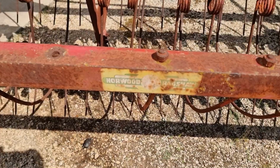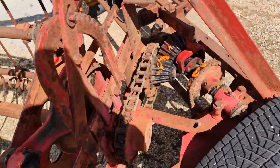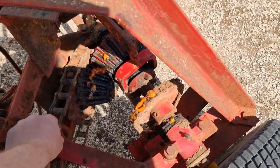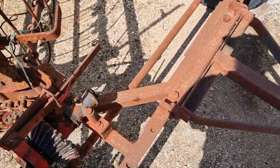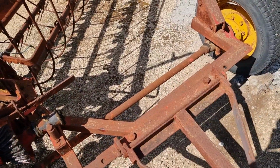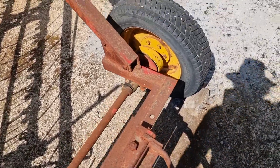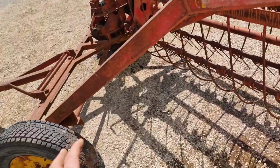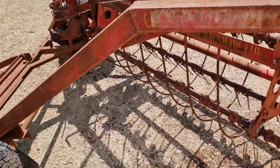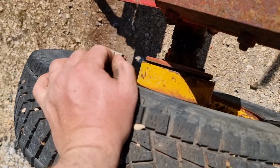So yeah, this is the Bagshaw. Everything's had grease, so I've just got to lube some chains up. And yeah, I've got the clutch working. The dog's clicking the wheels, so you can't actually disengage these ones. Which I think is a bit weird, because all the New Holland gear you can, but I guess they're driving in the same direction. It's only when you're turning corners that one of them freewheels, so yeah. It's as good as it's going to get for a while, I'm afraid.